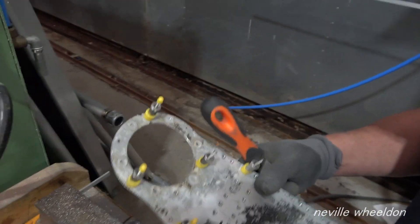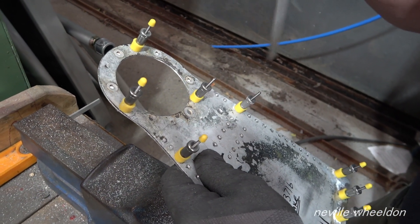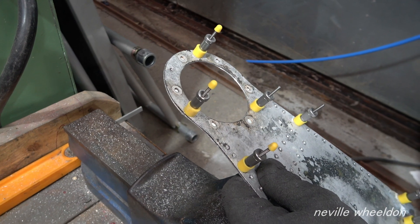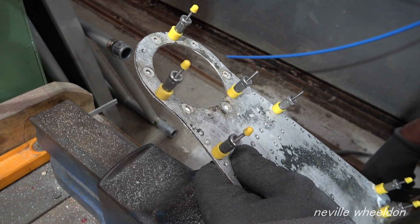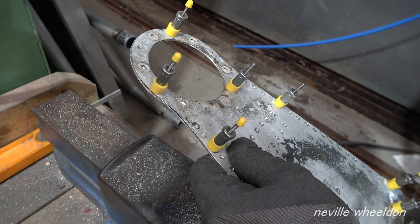Ones that we know aren't affected by that, and then just leave it. Terrible noise today. This hole here - how did you cut it out? Well, effectively you do a series of holes - chain drill it basically - and then just use a little chisel to finish it off.